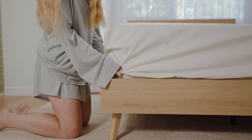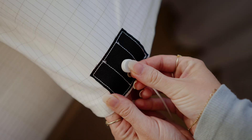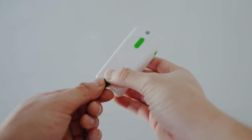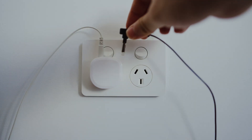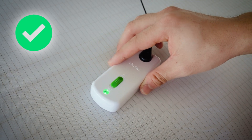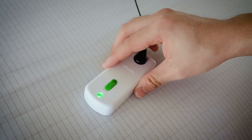Now let's go ahead and test it with our grounding products. First, set up your mat or sheet, then snap the grounding cord into the connector and plug it into the wall. Next, set up your continuity tester — plug the cord onto the connector and the other side into your grounding socket. Now the moment of truth: touch the metal on the back of the tester onto the grounding mat, and if it lights up green, it means that your mat is indeed connected to the earth and is conductive.